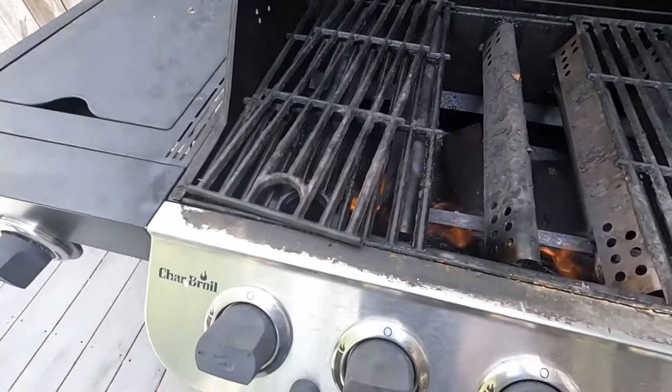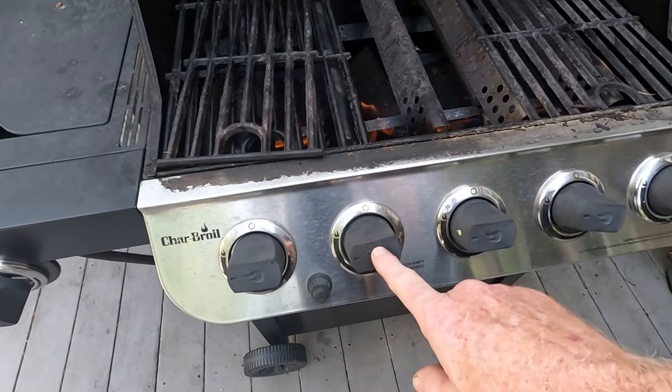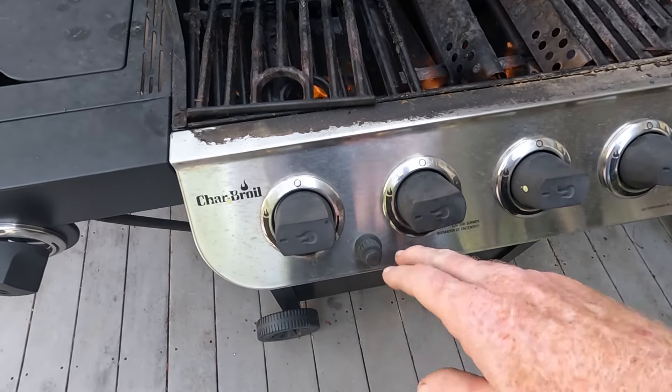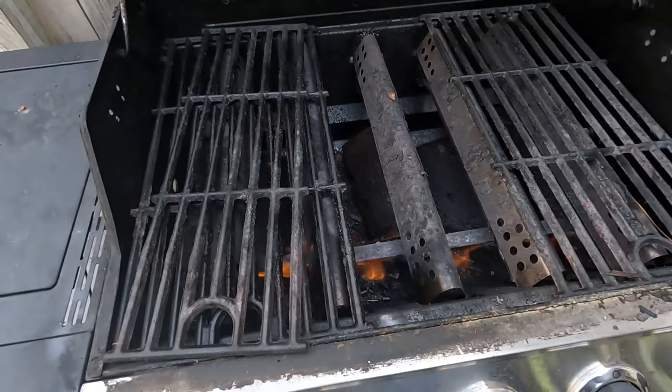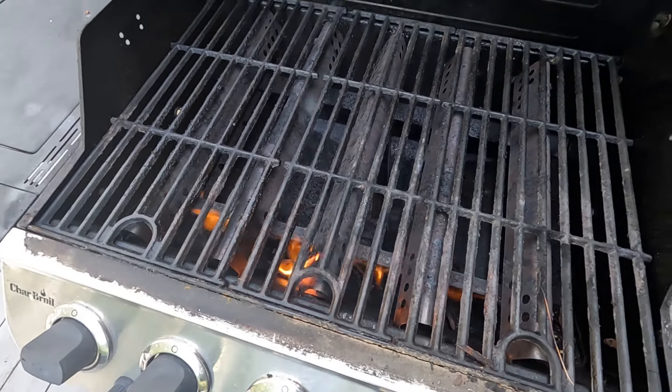So try that tip. Remember: turn on your propane first, then turn on your one ignition burner, turn that on and immediately light it up. Then turn your others on. That prevents the regulator from thinking that there is a propane leak, and that is how you can keep your grill going for a little longer. You don't have to wheel it out and go buy a new one over Memorial Day weekend. Just a simple tip that maybe will help you out this weekend or this summer. Like, comment, subscribe — let me know if you've got other tips to get your grill going and cooking strong. Thanks very much for tuning in, we will catch you next time.